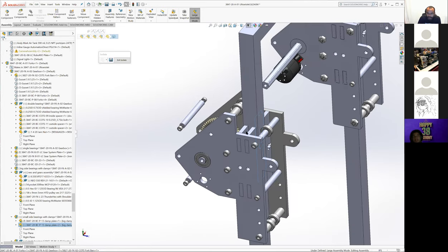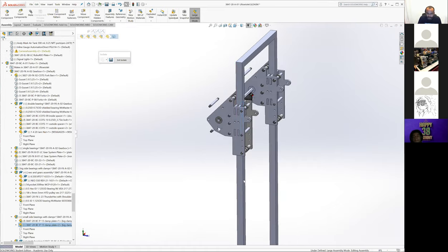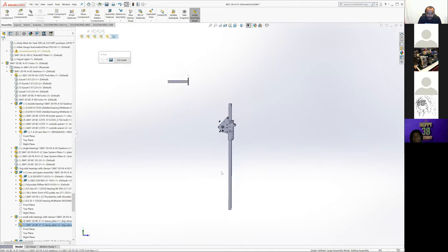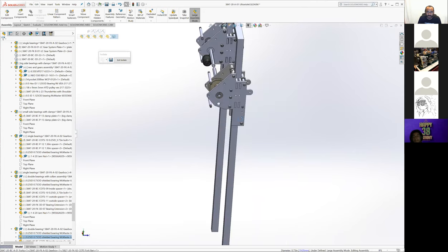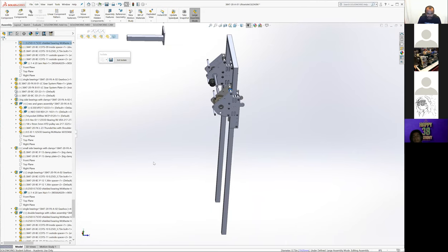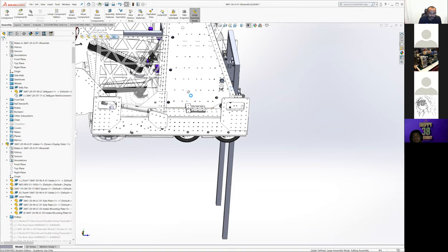And then once we were all the way at the bottom, these would get stopped somehow, so you couldn't pull them through tension. And then most of the load was going to be on this back set of bearings here and this front set of bearings, because you have this robot sitting out underneath our robot over here kind of trying to turn this whole assembly that way. And we never really got through actually building the fork assembly and testing a lot of that, because we assumed we'd be able to do that later. And then eventually we just decided not to use it throughout the season anyway, after seeing many other teams attempt these kind of climbs and them just not ever really working the way we wanted.